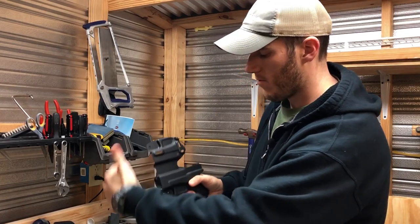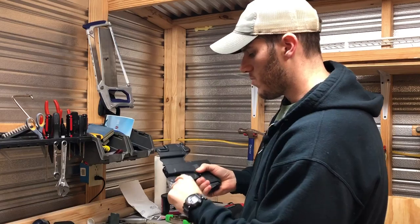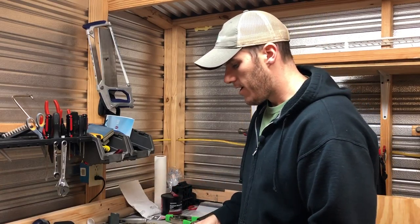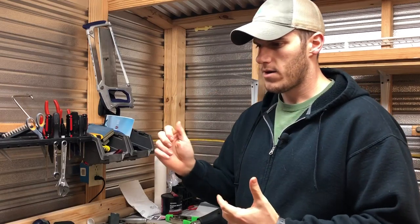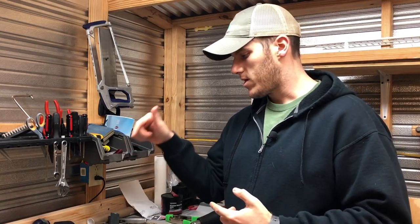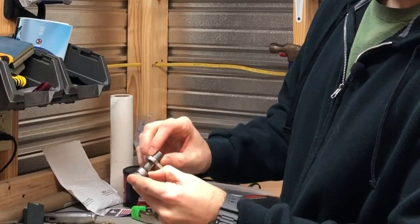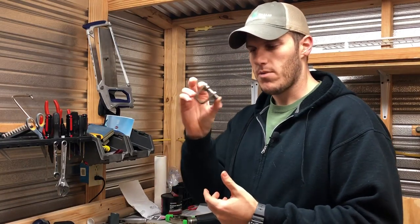Put a little heat in the middle here, fold it around the gun, put two rivets in to hold it - don't set them yet, just clamp it and wait for it to cool off, then set the rivets and you're good to go. All you need after that is some screws and mounting hardware, and you're done in maybe 10-15 minutes total - with grinding, sanding, heating, and folding. Really the only specialty tool you need is the rivet setter die and punch.